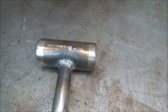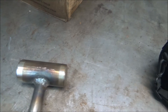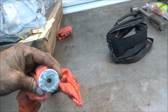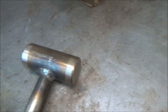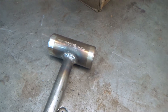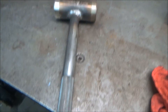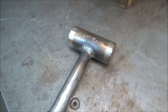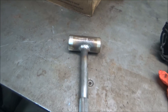I got it finished. I didn't realize it was welding pretty bad and that I was running out of argon — so every few seconds the tungsten would keep getting contaminated. It's not perfect but it's just a hammer, so I guess it doesn't really matter. I'll do a bunch more lathe and MIG welding projects in the future. I'm going to do a scheduled upload on this — when it comes out I'll be in Florida at a YouTube wedding, probably the first one ever. A few other YouTubers will be there also.